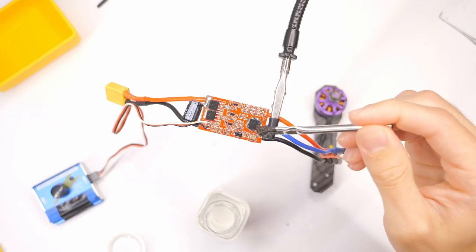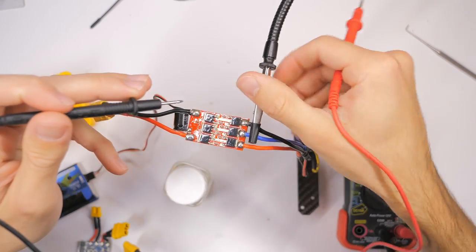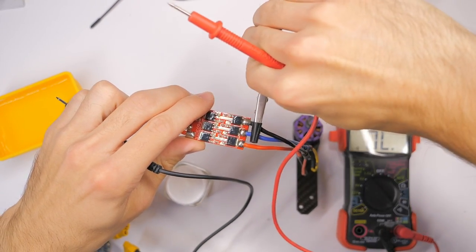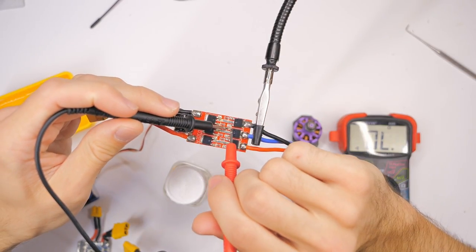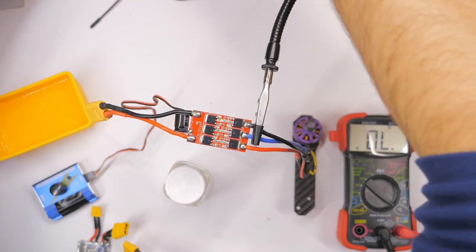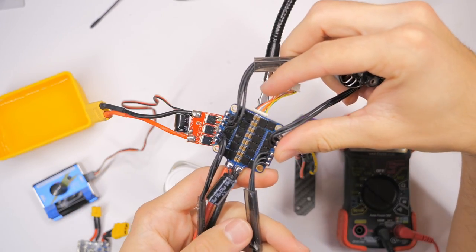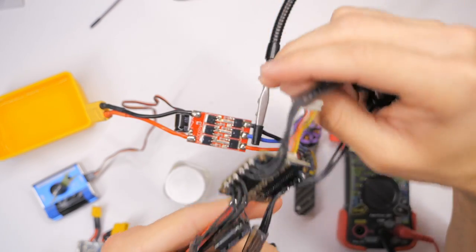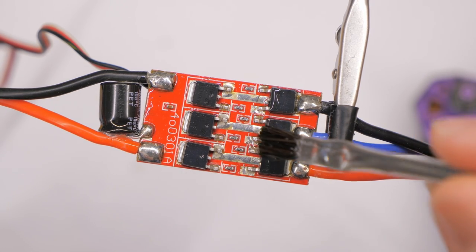I applied another coat and used a multimeter this time to check for continuity on the pins of the FETs and other areas where I suspected there was a problem. Since I was getting a beep from my multimeter between the probes, it was clear that the silicone was not even covering those areas. It's worth mentioning that a modern 4-in-1 ESC, if we're talking about quad stuff, doesn't have those large gaps — so that is way better and way easier to waterproof. So I applied even more in those problem spots.